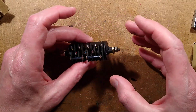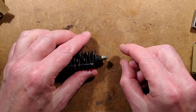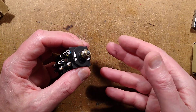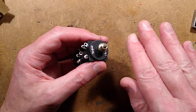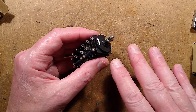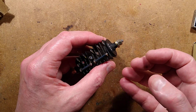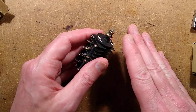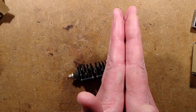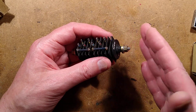Each of these plates is a diode. They make them by getting a piece of metal and putting a coating of doped selenium on it — basically selenium with a slight impurity, just to adjust the characteristics to what they want. Then they coat it with a layer of a metal alloy and heat it up. When it reaches the annealing point, the two layers fuse: the metal surface actually fuses into the selenium and creates the semiconducting junction.